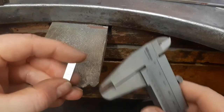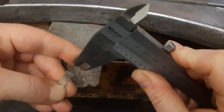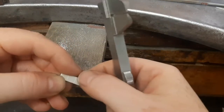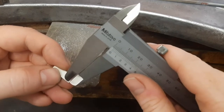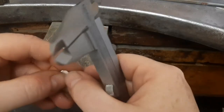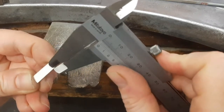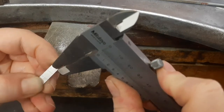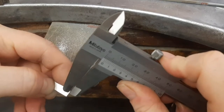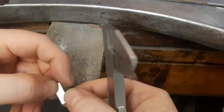Using the vernier gauge, I'm marking all the way around 1mm — set to 1mm because that's the thickness of the metal. So when you're chamfering — chamfering is filing something at an angle — for a cube, you want to create right angles all around. A 45-degree angle is what you're looking for on both pieces to create your 90-degree angle total.